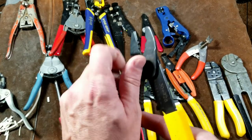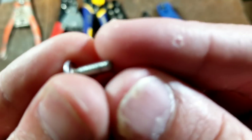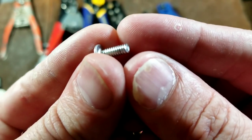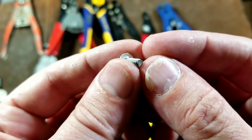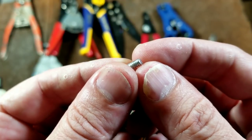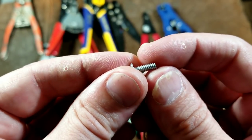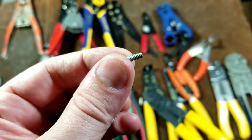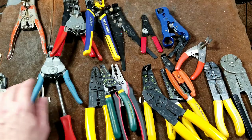you can unscrew it, and you can see here, I just cut that fastener, and I was able to unscrew it by hand. If we take a close look, if the camera will cooperate, there we go. We can see that it was actually sheared off pretty decently, and because the end of it was supported in a threaded hole, it will not give you any trouble actually trying to get it started. So I did want to mention that as another important tip.